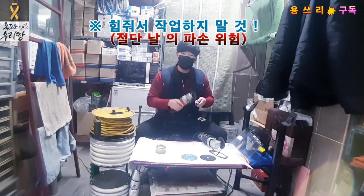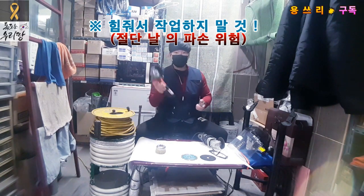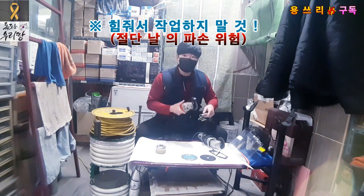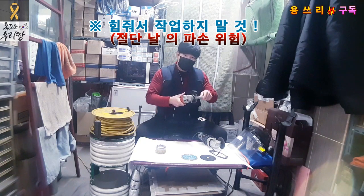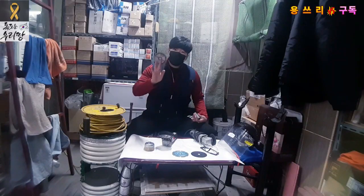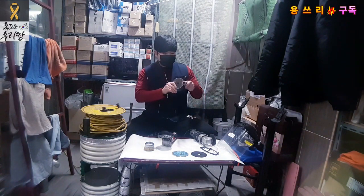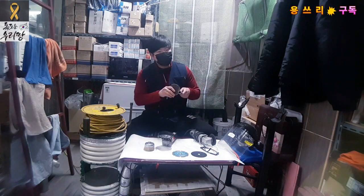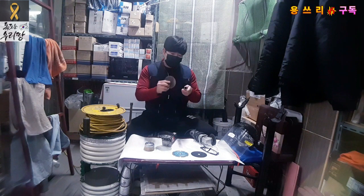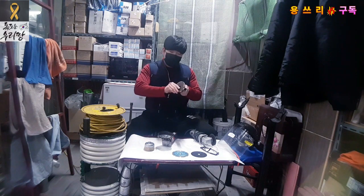So work carefully to protect your body. It's really difficult. You can see the pressure on the grinding surface. This is a lot of pressure. If you press too hard on the disc, you can feel a lot of pressure, and the heat builds up. When there's too much heat and no airflow, the disc can overheat and break.